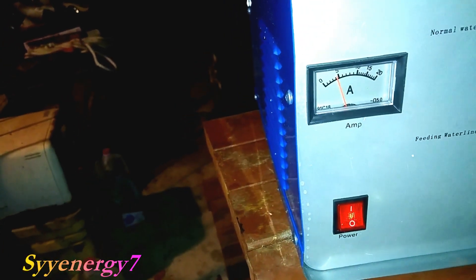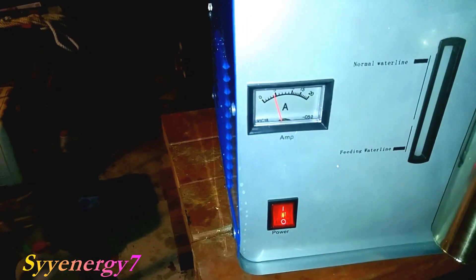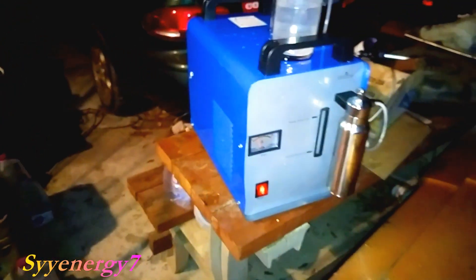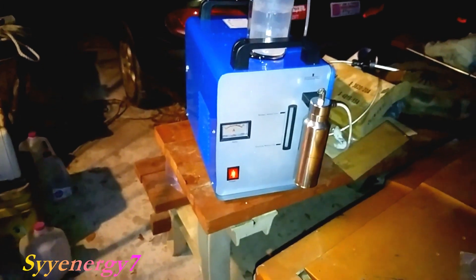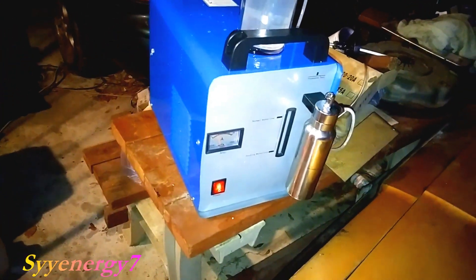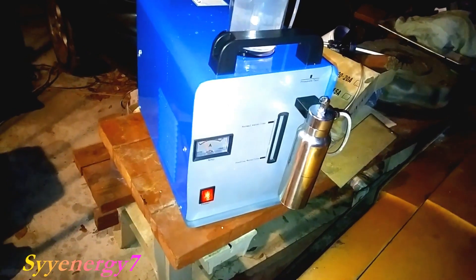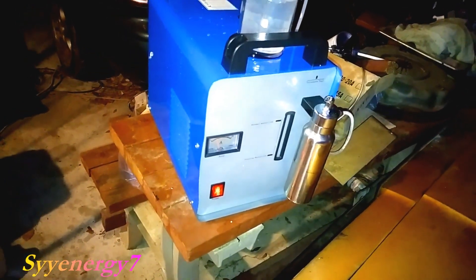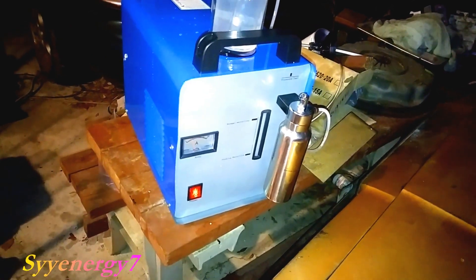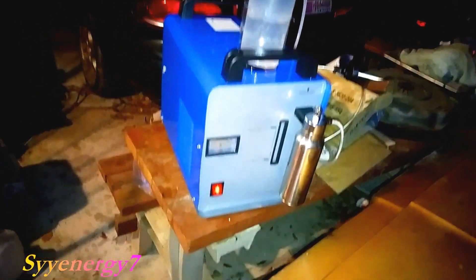It'll go up to probably about eight amps because of how much electrolyte I put in — almost two level teaspoons. In the beginning it seems like you have to run a little while before it hits its stride, like it's got to break in or something. This setup is more of a pain than I thought — the slightest leak with hydrogen will make it not work. An air leak has to be sealed better than a water hose, and with hydrogen it has to be even more leak-proof because the molecule is so tiny it doesn't take much for it to leak.